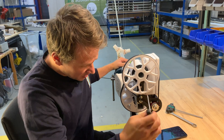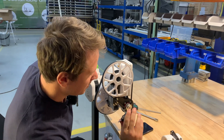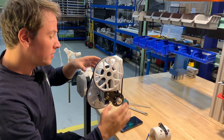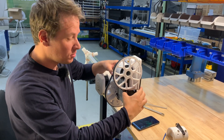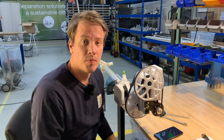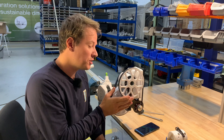Then we're going to tighten it down. Make it good and tight — don't want it to come loose. I like to go by feel: does the belt still feel as it did before? If it does, then I'm satisfied. And that's how to tighten the belt and make sure that you have the right tension on your belts.